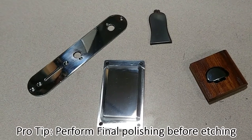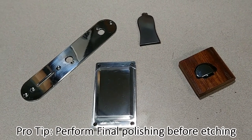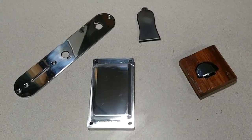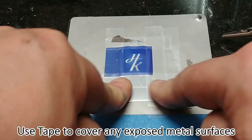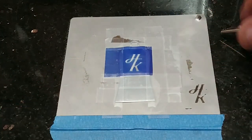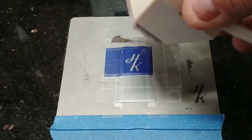Here's a tip: when you're going to etch a piece of metal, make sure you polish it out perfectly beforehand, as best you want it. After etching, you won't be able to clean the metal as well without damaging the etched design. We've got the stencil for the Hard Knocks logo laid over the truss rod plate. Use scotch tape to cover all exposed metal except for the logo area. Hook up the ground wire, apply the aluminum electrolyte to the pad, and etch for a count of ten.